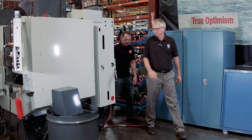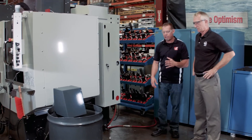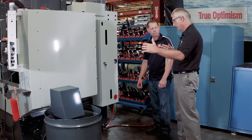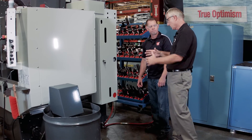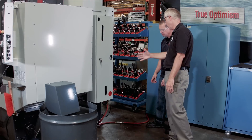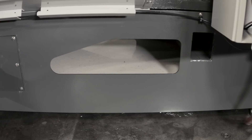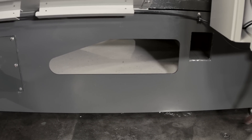Walking around the machine, what's really obvious is the larger opening in the coolant tank. The old Mini Mill was a little hard to clean out. We had big openings on the sides, and because of the longer tank and moving the lubrication system off the back, we added a giant hole in the back too. So you can take a shop vac, stick a long nozzle in, and easily get every corner of the machine without much effort.